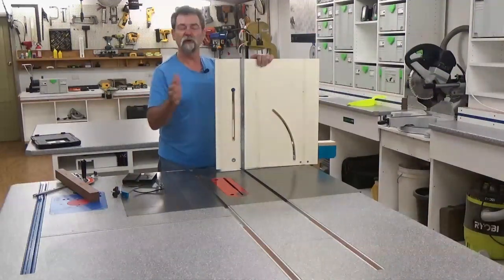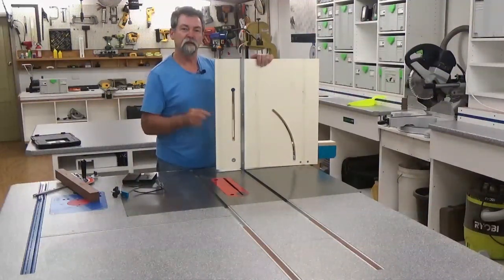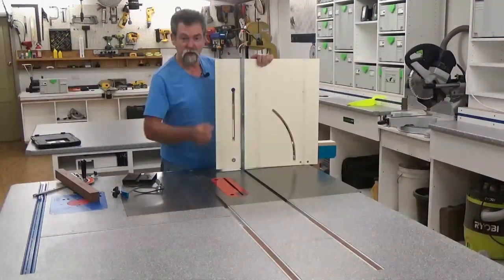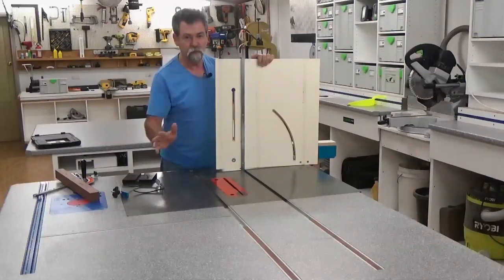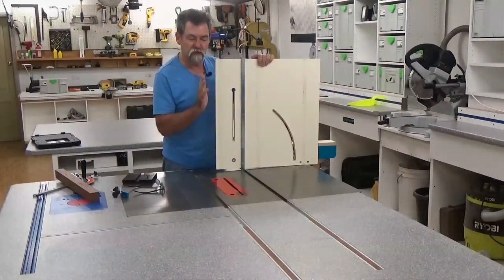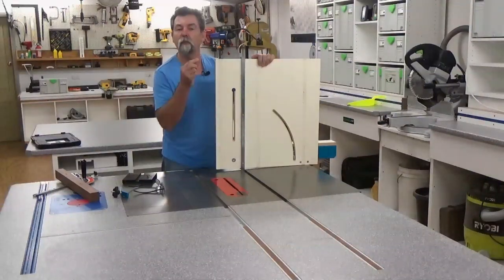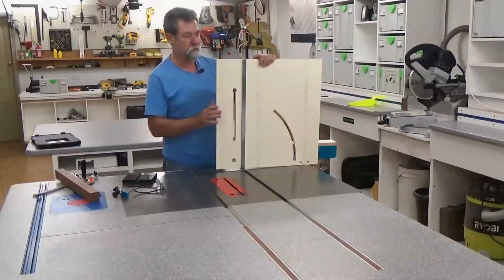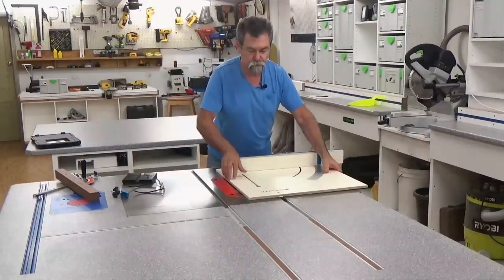So I can go into all the reasons why the grub screw wouldn't go any deeper and all that kind of stuff, but it's a waste of time. Second spring, 2 springs in those 3 positions, beautiful. You must tension it up a little bit and then back it off just so that it's right. If you do it too tight, the ball bearing will not turn at all. But backed it off just a little bit, holds it perfectly. There is no slop. Absolutely accurate.